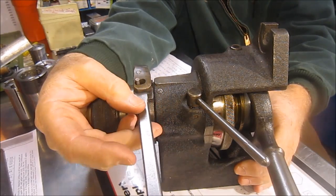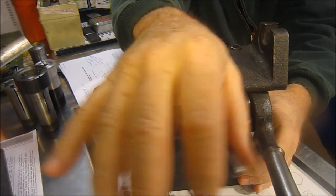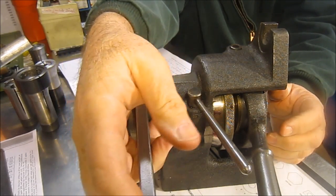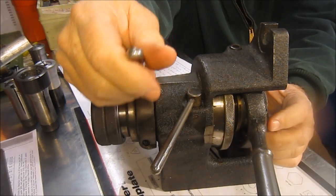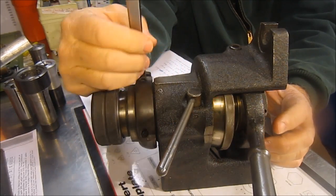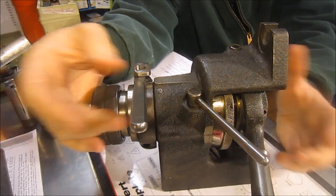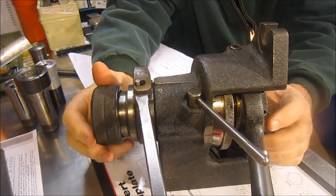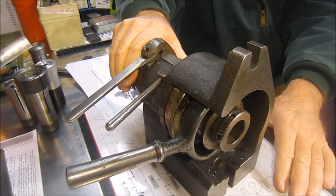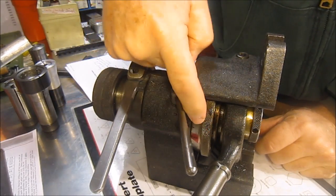There's a ratcheting mechanism and then there's the lever that releases from the pins and the plate. The way it's set up is you can actually release, index, and it drops back in — release, index, and it will drop back in. So there it goes right there. That depends on where the pins are set in the back. Hopefully getting it correctly there so you can see it — there's your indexing right here. There are 24 holes in the index plate, and you can pick any of those holes that you want to index on.